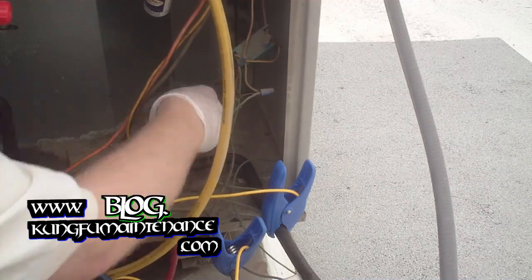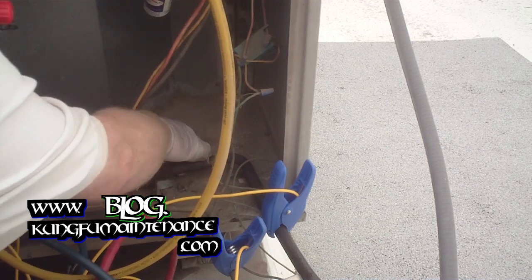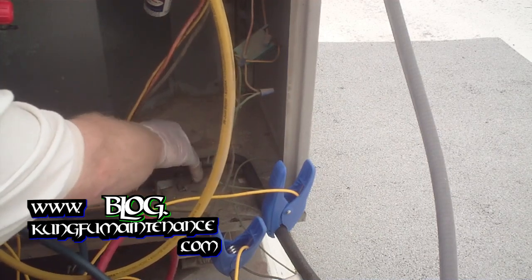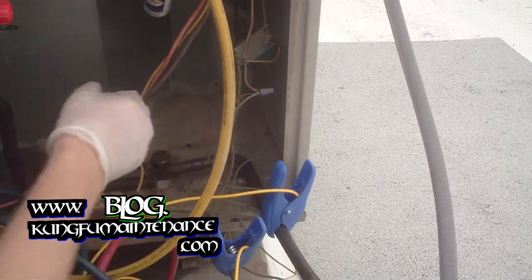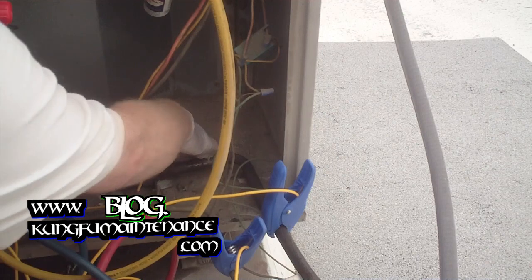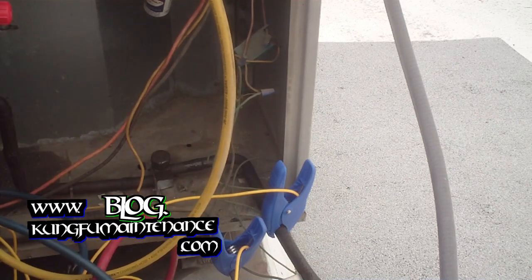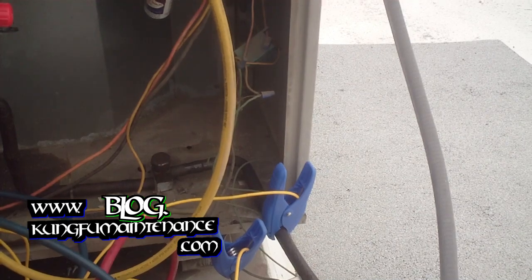Schrader valve with our O-ring in the top. Finger tight, as tight as we can get. If you have to use a tool, it'll only go a quarter turn past tight — a quarter turn is just a quarter turn. You really don't need to use a tool. You can always check these with some soap bubbles or an electronic leak detector to verify that they're not leaking.